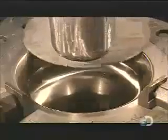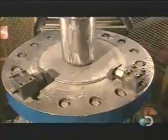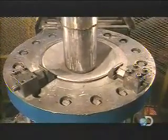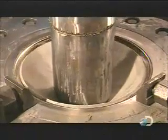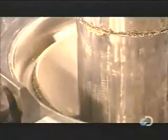After a quick drying period, each disc moves over a die. This process is known as deep drawing because a series of machines will gradually draw out the disc to the shape of a cylinder. A mandrel press begins stretching the metal, applying up to 800 tons of force, the weight of 2 fully loaded jumbo jets.